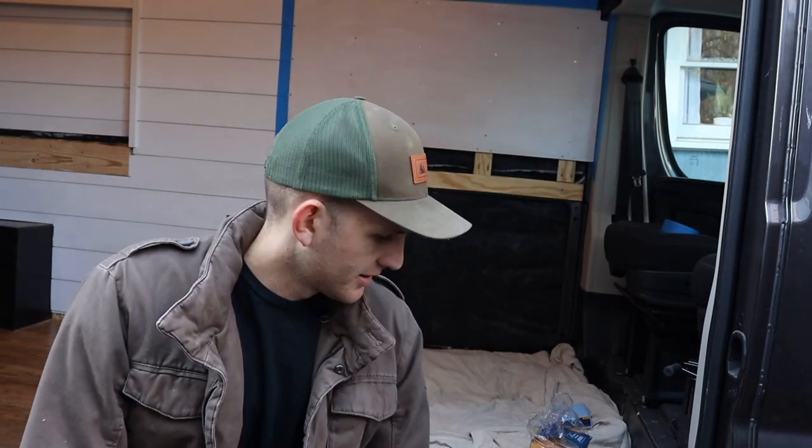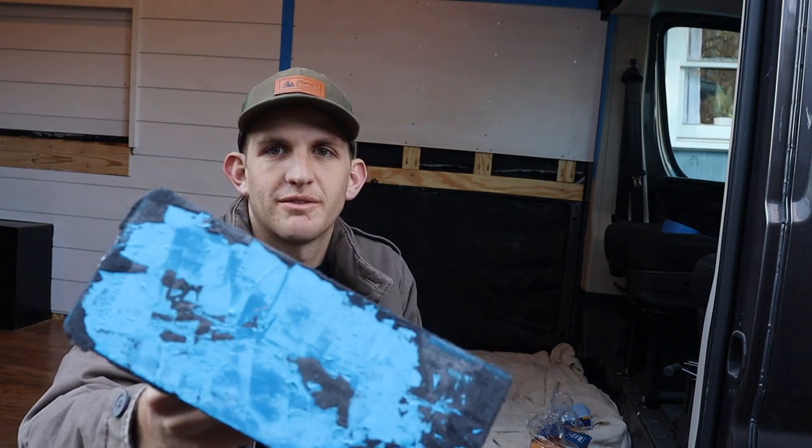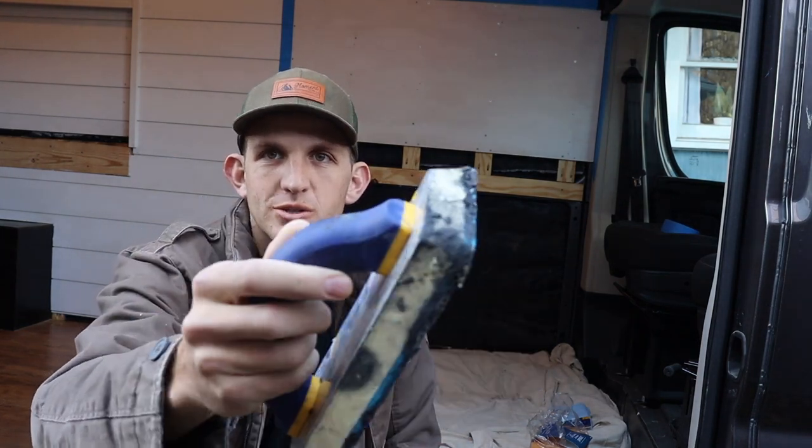This can be a black grout. This stuff works a little bit better if you get the walls or the tiles a little wet, like moist with a sponge, and then you set it on. It works really easily. It does kind of make a bit of a mess. That's why we have that drop cloth on the ground. To spread that stuff on, we have one of these floats, which is what they're called, a grout float. So that's what we'll use to put that in.